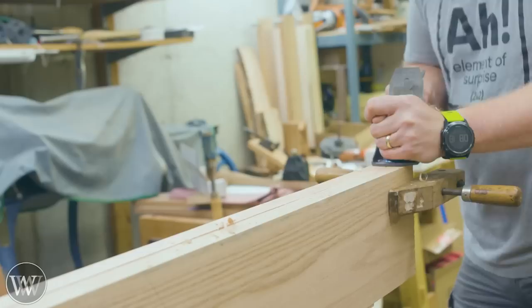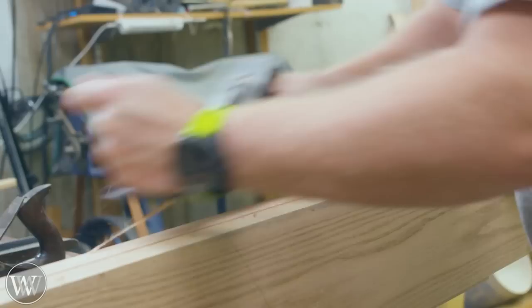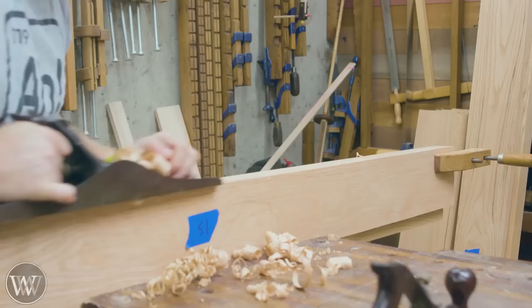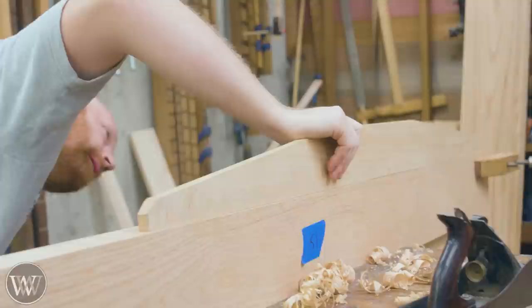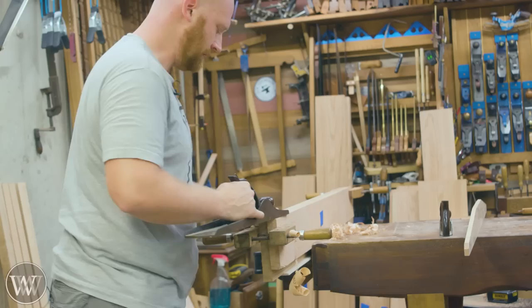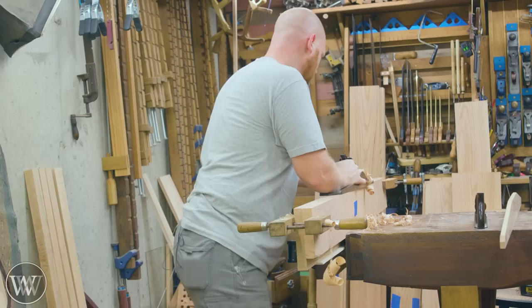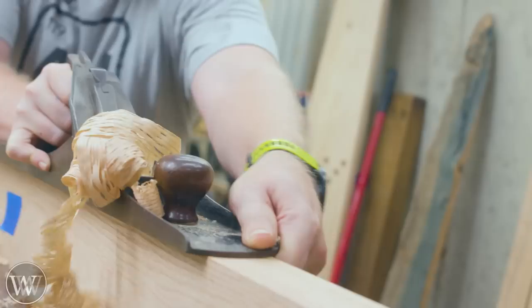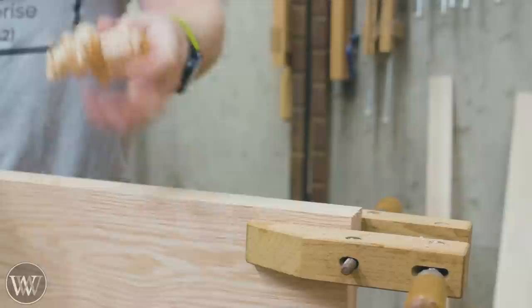This way when I flip them out they join to each other, and any imperfection in one will be matched in the other - so if there's any angle in the plane they cancel each other out. I'll use a scrub plane to get rid of the really high spots. Some of these boards were pretty well twisted, so they can take off quite a bit. Then I'll come in with a plane that takes off a heavy amount, then use the jointer. These boards are 60 inches long, so I really need to check them with a straight edge as well. The number eight jointer plane is really useful here because it's wide enough to cover both boards at once, getting a nice clean shaving all the way from one end to the other.